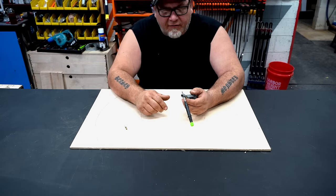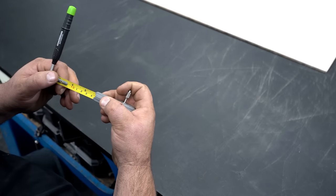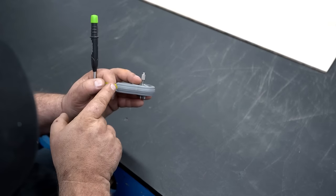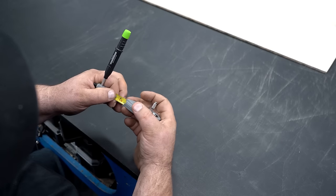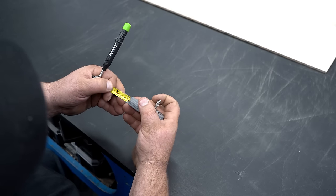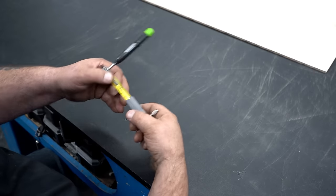This makes marking large circles really easy in a very nice compact form. When setting the measurement, there's a little cutout and that's where you want to put your measurement — not on the end. So if I wanted a five inch radius, I would put the five inch mark right inside that little cutout and then mark out my circumference.